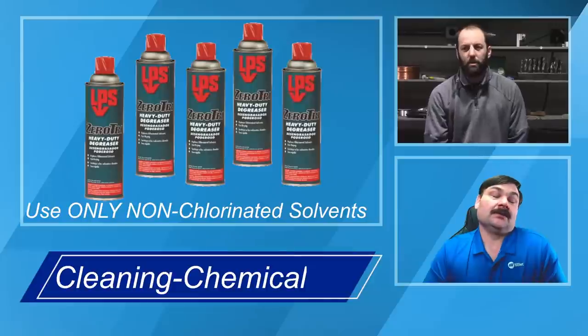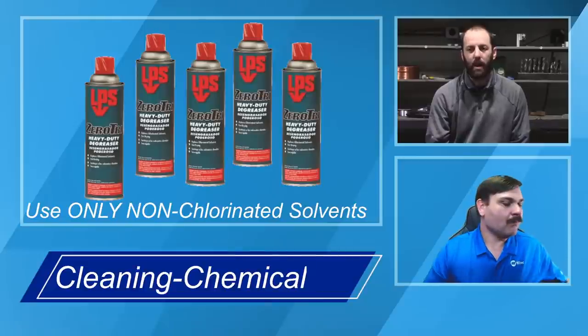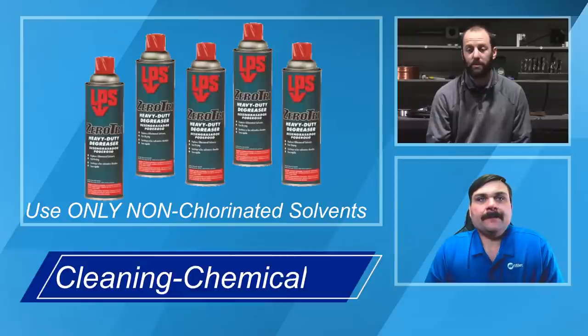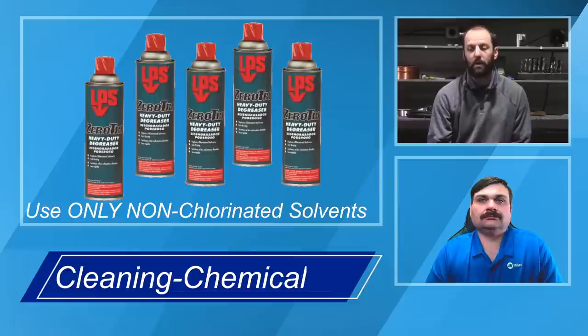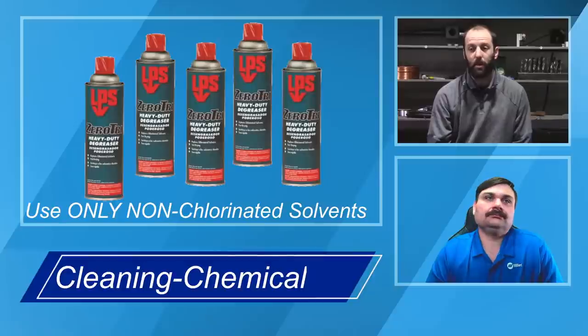Yeah, so in regards to welding, some of the ones that I've seen, I'll start with our recommendation, and kind of do a big loop back around. Our recommendation is the LPS ZeroTri. This is an aerosolized solvent-based cleaner. One of the big notables here is to use non-chlorinated cleaners or solvents. Some brake cleaners and things like that do have chlorine in them, and when exposed to UV light, which is essentially the welding arc, that can create a potentially hazardous environment. So we would like to avoid that, and that's why we recommend something like the LPS, which is one of the better options out in the industry.